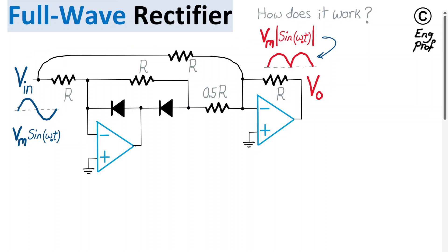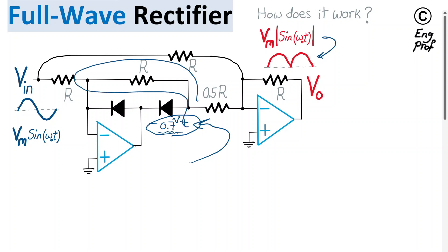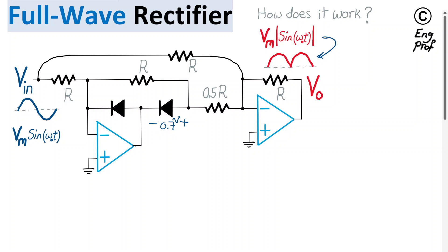One benefit of this circuit from the outset is that the forward bias voltage of a practical diode is usually nominally referred to as 0.7 volt, but this 0.7V varies over time depending on temperature and other parameters — it's not well regulated and is very temperature sensitive. This circuit is able to overcome dependency on this variable value by using the negative feedback available in the active implementation of the full wave rectifier.